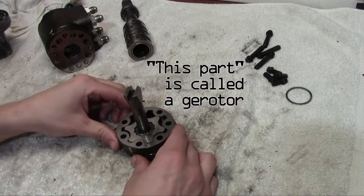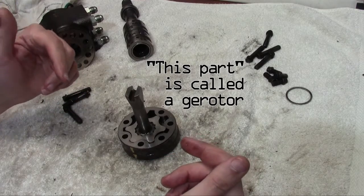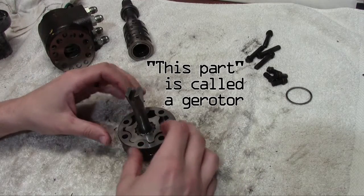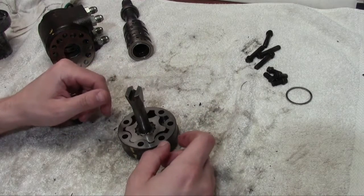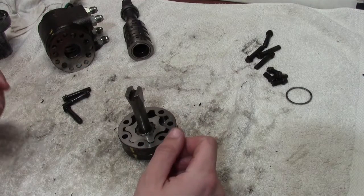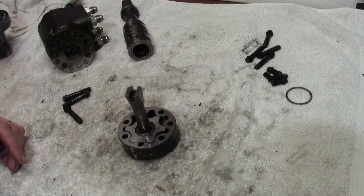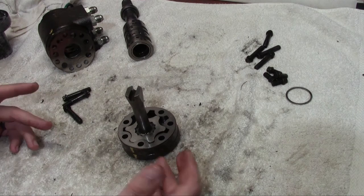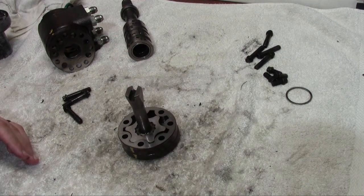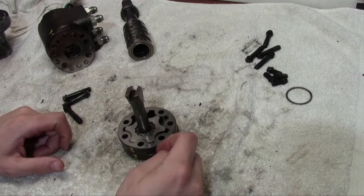This part is what actually controls how much fluid is flowing, so it will be varying in size based on how much displacement your orbital valve has. Obviously the bigger this section, the more fluid — the more cubic inches per revolution this pump will actually put out — which in a steering system basically fills that cylinder faster, allowing you to steer quicker. Bigger valves mean fewer turns lock-to-lock because it takes fewer turns to fill up that cylinder with a larger displacement through your orbital valve.